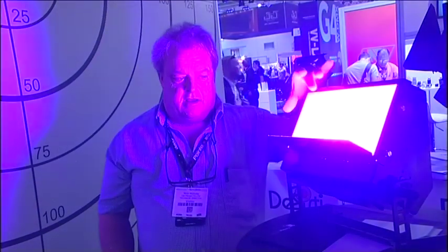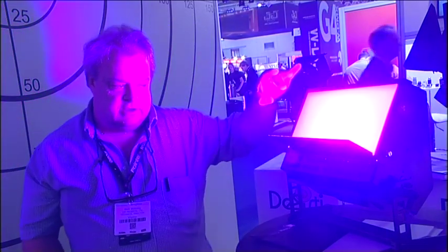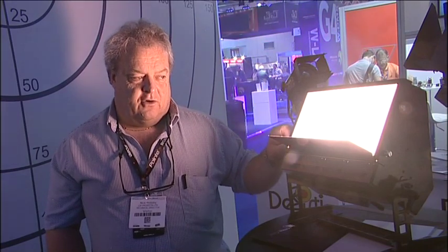As you see, it's a relatively compact unit, lightweight, around 5 kilos. Equivalent electrical power is between 75 and 150 watts. And it comes in a variety of formats to suit the different markets, whether it be theatre or television. What we're showing here is a television product specifically designed for TV studios where we have an R, a G and a B LED, and also two white LEDs which are colour temperature corrected for television use at 3200 degrees